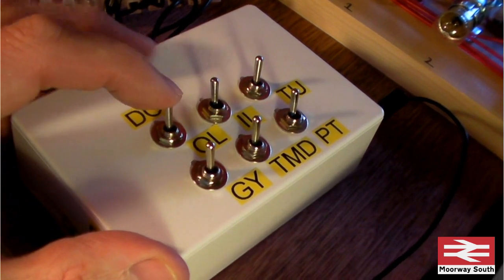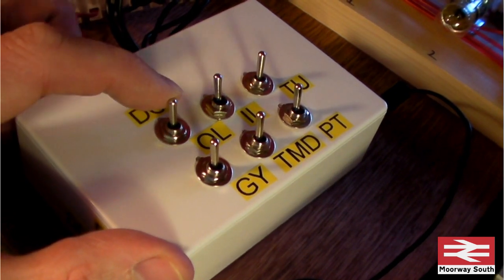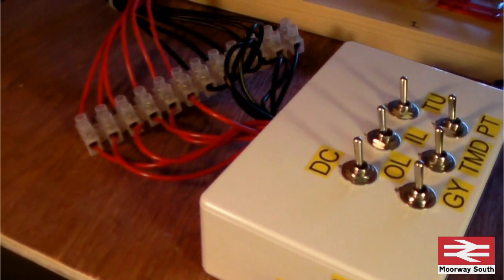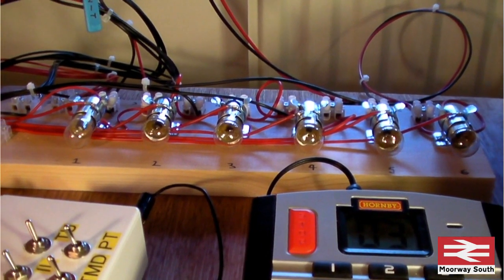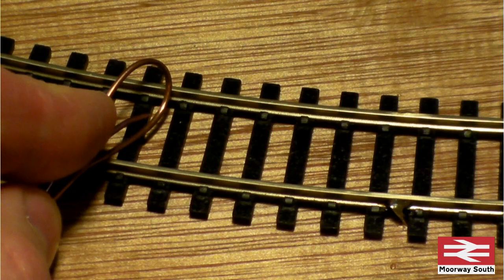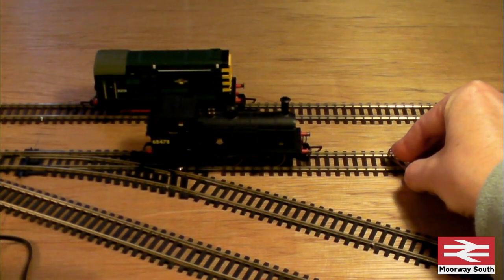The outer loop has the option of having DC supply to it when it's switched off, which allows me to run DC locos or have DC locos running on the track at the same time as DCC. When that's switched on it goes over to DCC supply. The 6 individual power lines for positive and 6 for negative then go through a terminal block and into this board I've made up, which has got 6 car bulbs on it. When there's a short circuit across the tracks, there's a very high current flow — no loading — and that's what the controller detects and cuts off the power. So when the short circuit protection kicks in, all the supply to the track goes off and all the locomotives running will stop.